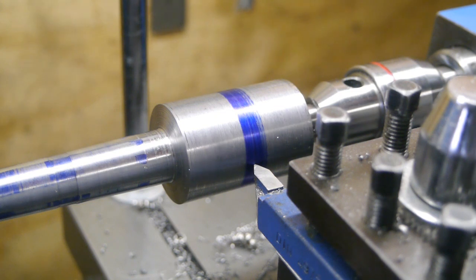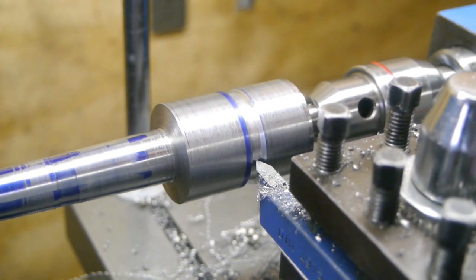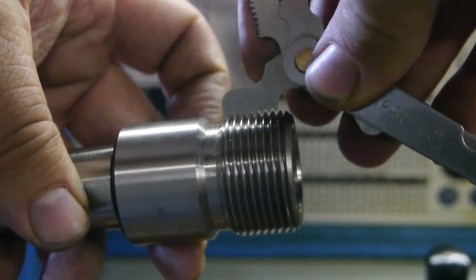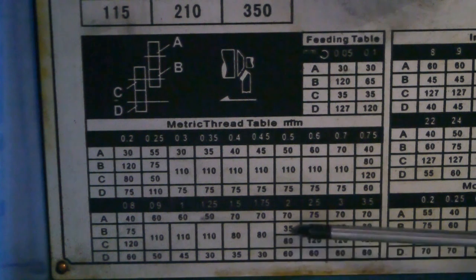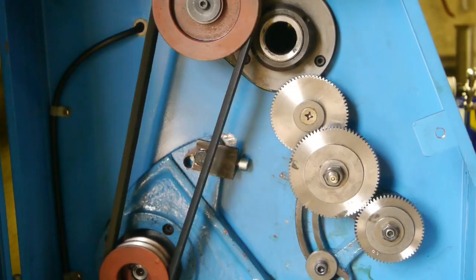All right, I'm now gonna cut a groove to relieve the threading tool — and that should do it, I'm just eyeballing this. The groove on the original is deeper than really necessary. According to the thread measuring gauge, this is a 2.0 pitch thread. According to the table we need 80 and a 60 gear. I got lucky — the correct gears were already on there, which is a plus because I hate changing these things.